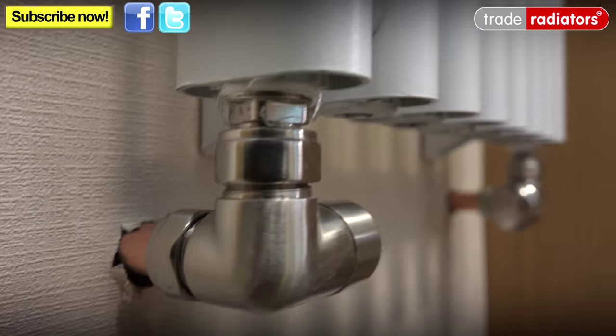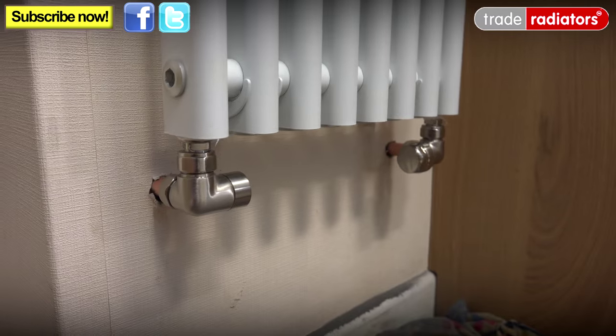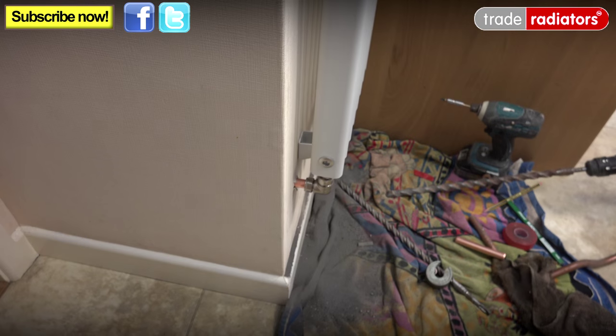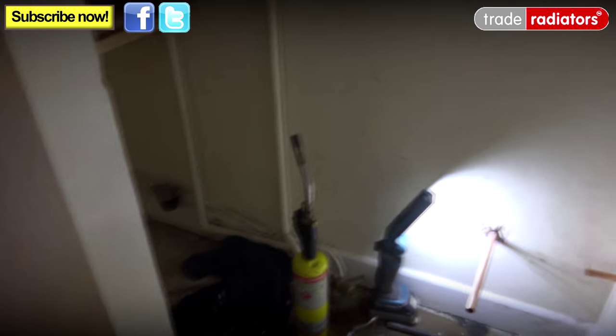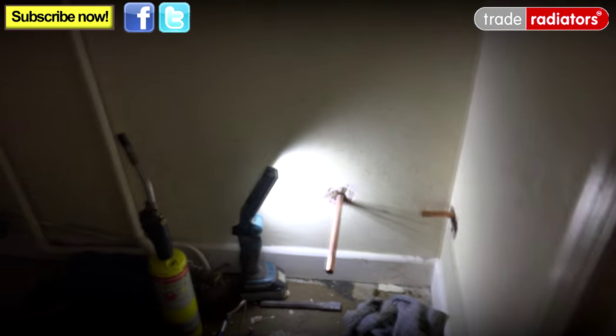The two valves are in here absolutely beautifully, and if you look from above you'd never know there were two pipes going through the wall — the amount of pipework sticking out is really minimal. Now we just need to go back through and connect these two pipes to the 22mm flow and return for the heating system. I'm also going to pop a couple of isolation valves on there so if there are any future problems with the radiator they can valve it off and just drain that section down on its own.